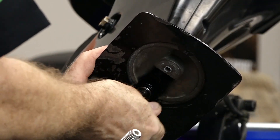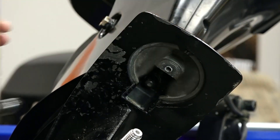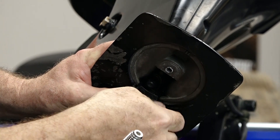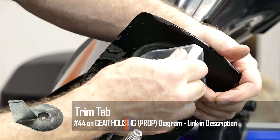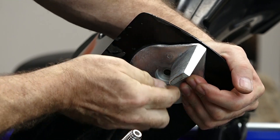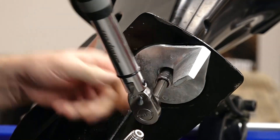Which is a 15 millimeter. This one is 40 foot-pounds as well. There's a little grate right here that we need to get back in. Now we can get our new trim tab on there — the other one was broken if you remember. We're just going to set it at zero because we don't have a point of reference on this one or the one that came off since it was broken. And this one is going to be 16 foot-pounds.